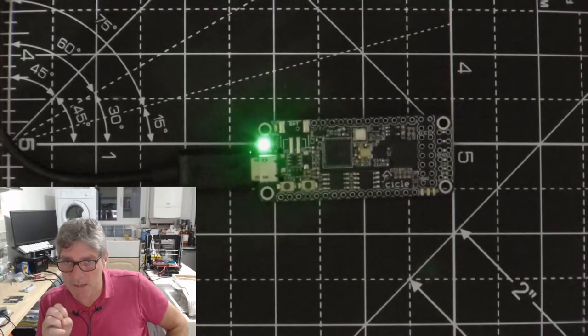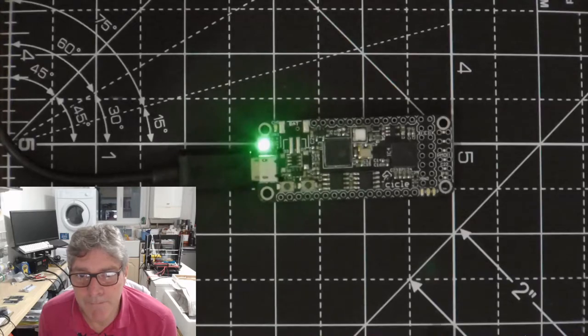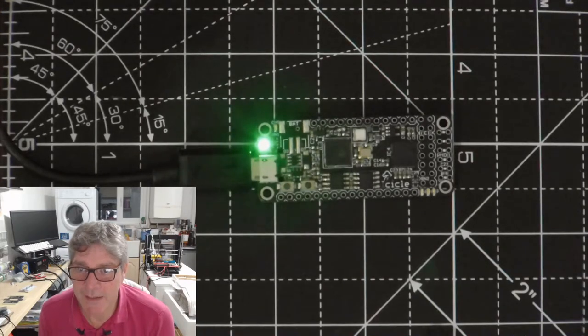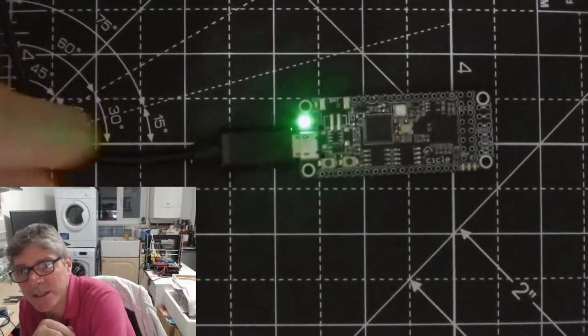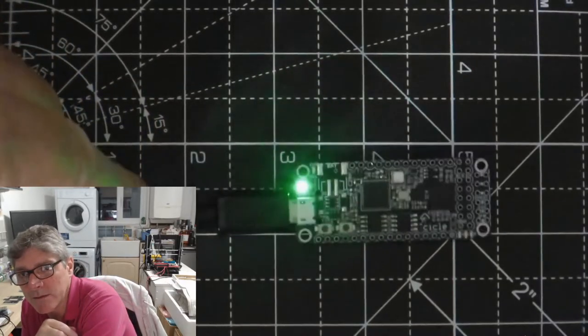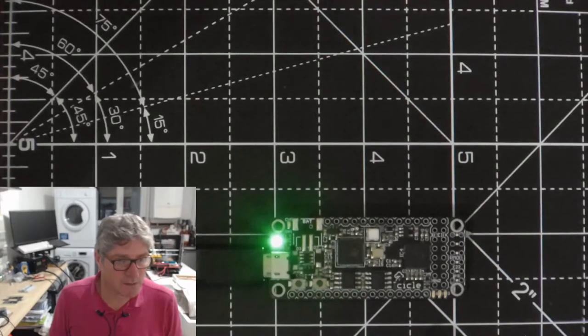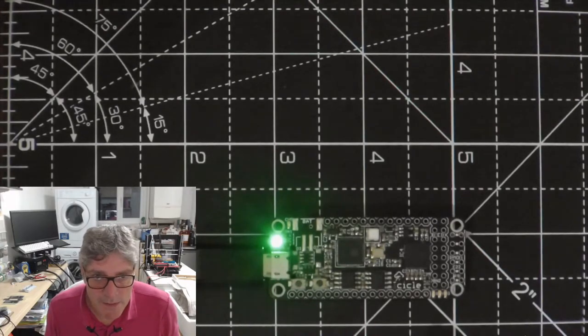Turns out there's a few subtle settings depending on how the software is written. So for example, in the Saleae logic analyzer settings, I have to choose a capture method, Windows 10, 1903 and up. If I don't do that, or if I leave it on auto, it just ends up with a black screen, which is a bit frustrating, frankly. There you go. So this is all now operating as it should be. And I'll go back to community stuff in a sec.